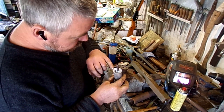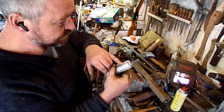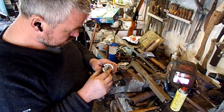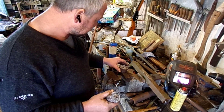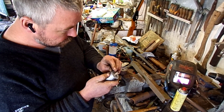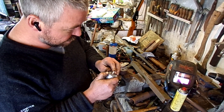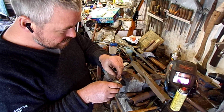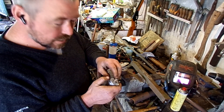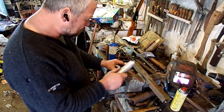Yeah, we got a lot of shrinkage as expected — goes about 20 mil, an inch, down. The aluminium bonded with the not-quite-as-cured refractory. I have found this in foundries where I've spilled a bit of metal — it tends to adhere quite well. So yeah, maybe this wasn't the best idea.